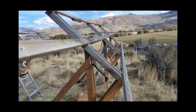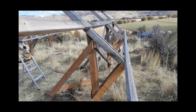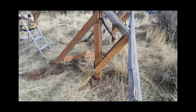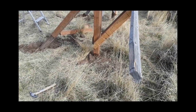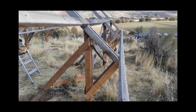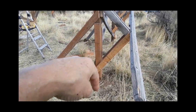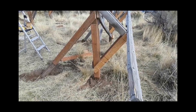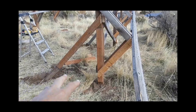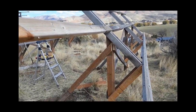Let me show you something about construction technique. I live in an area where it gets dry in summer but we get a lot of snow, so the ground gets good and soggy wet. If you put a post in the ground and it's not treated, it will rot in two, three, or four years. So use pressure treated lumber — I assume it's pine — for anything that's going to touch the ground or be in contact with it and could stay wet.